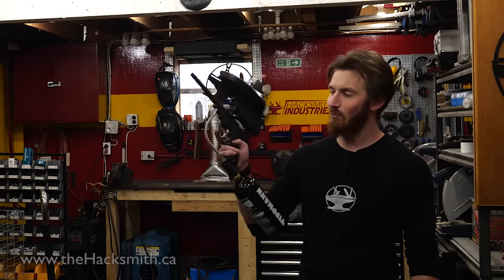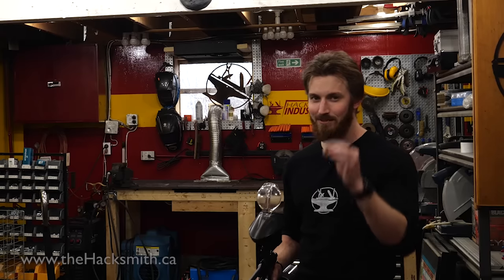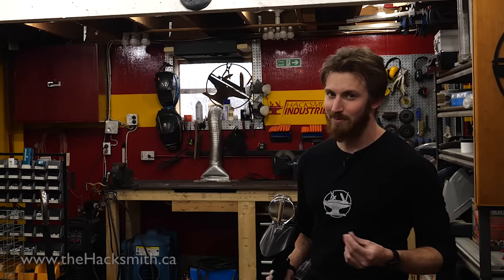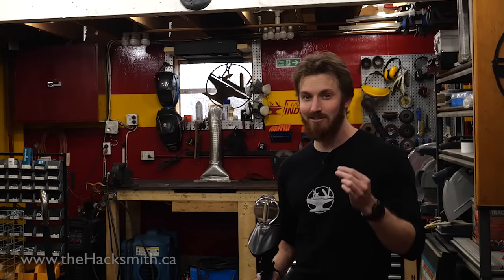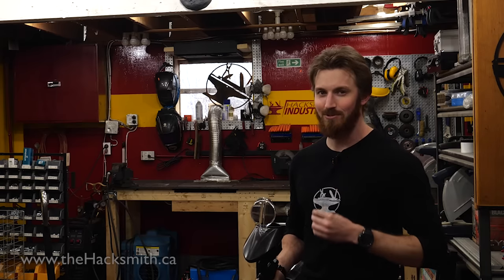All right, so you might be wondering why we have a paintball gun attached to the railgun, and that's because you do actually need to initially accelerate the projectile. Because if you just put this in between the rails and turn the capacitor bank on, it would literally weld itself shut. It needs to have a little speed at the beginning as it's entering the rails.